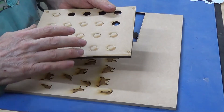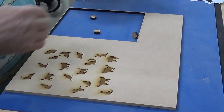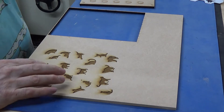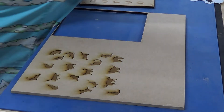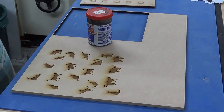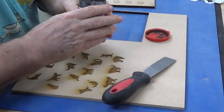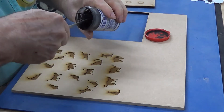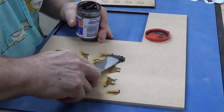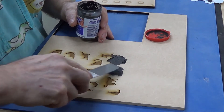So what I'm going to do is wood-fill these. I use an ebony wood filler with a small spatula. Look, there's nothing magical to it. You fill it in, let it dry, sand it down, and then fill in all the hollows after that. As you can see, it's fairly quick because there's not that much to it initially — not the first pass anyway.